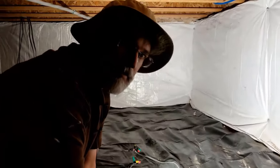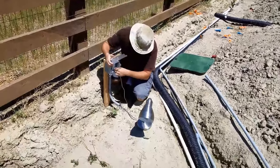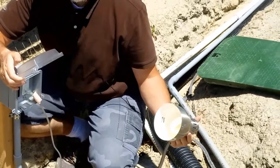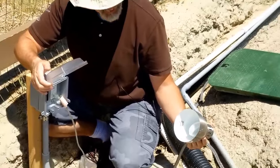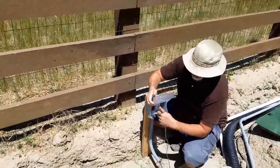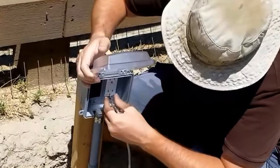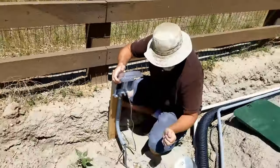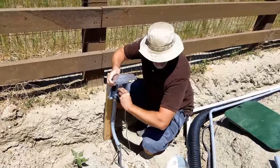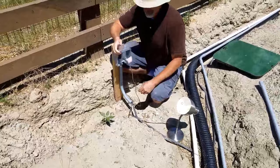Final test — I already tested the other one and it's good. I've got it plugged in and let's see if this shows up on screen in the daylight. It's on. One thing to know if you're not familiar with GFCIs — there's a chance it might have been tripped. There's a test button to trip it and a reset button. I'll demonstrate: press test — now it's tripped and not on. Press reset — and it's back on. So if it doesn't come on, check that reset button.